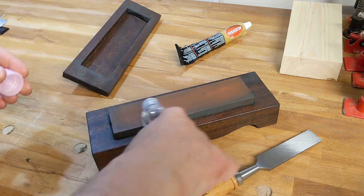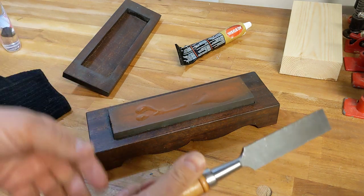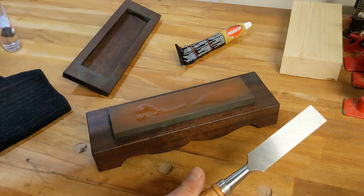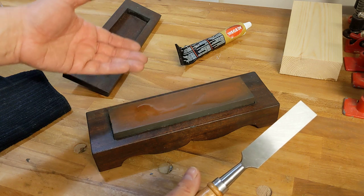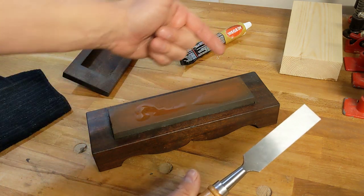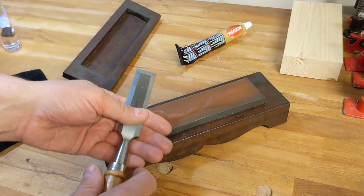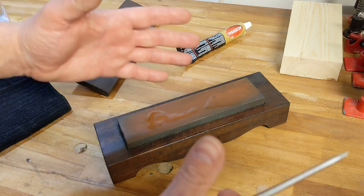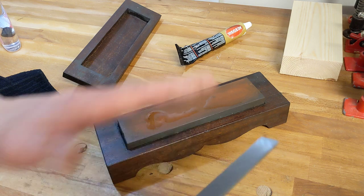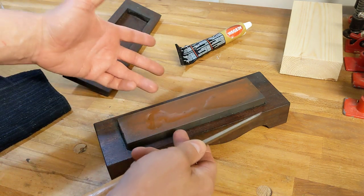You can choose whatever medium you want to sharpen and look after your gear. If you're starting out and don't want to spend a lot of money, I can highly recommend the Norton India combination stone — eight inches long, two inches wide. It's got aluminium oxide on top and silicon carbide underneath. I pretty much just use the fine side for everything. These will last forever; diamond plates won't, water stones won't. If anybody has worn out a Norton India through use, please write in — good luck to you. You can still pick them up secondhand. I've seen videos where people use a piece of glass with wet-and-dry stuck on it, but if you've actually got to buy all that wet-and-dry and mount it on something and faff around — it's not needed.